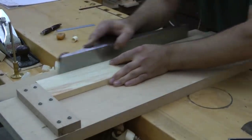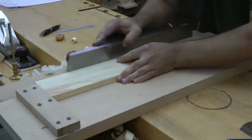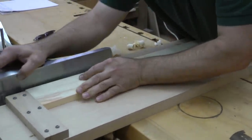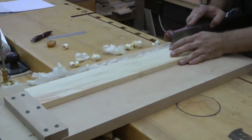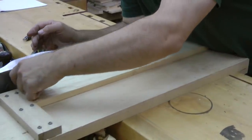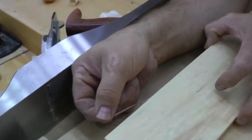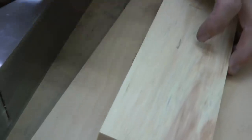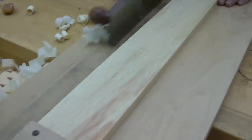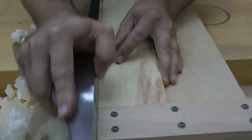I will just go as far as I dare and then pull the plane off. Now I can go full length. That is really close. There is a little feather edge that you can see right here — the marking gauge knife leaves it, and you often use that just as a gauge to determine where you are. That looked to be pretty much the same all the way along, so take one more pass.